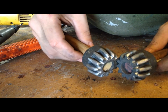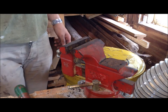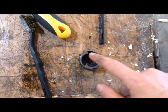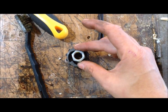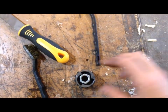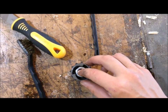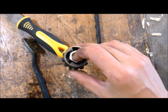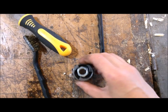I got them to a point where they were connecting and spinning. The reason for using a half-inch nut is not only will it fit on that shaft, but the back side of these gears has keyed grooves which matched a pattern on the lawn mower so it couldn't move. This half-inch nut actually fits in there just about perfectly. So if I have that nut in there, I could slide this whole gear onto that shaft, add a set screw, and it probably won't move. To make that happen, I'm going to fill this negative space with epoxy — not necessarily for strength, but strong enough that once the nut is in and the voids are filled, the nut won't move around.